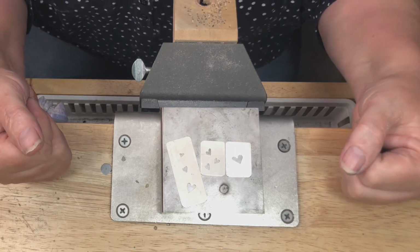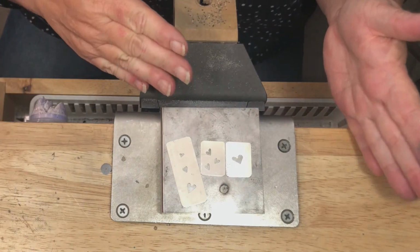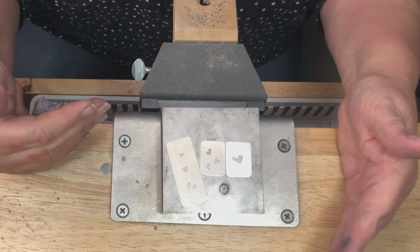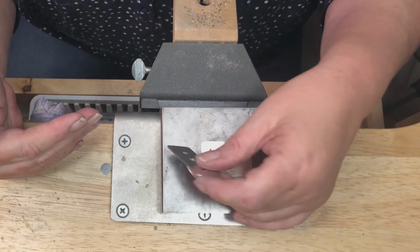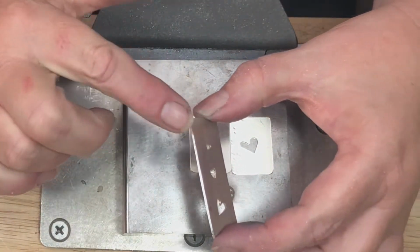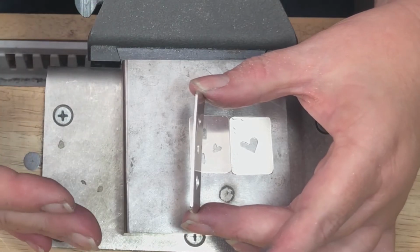I see pieces a lot of times with beginners, and they have really cute designs and they've done a really good job, but I can tell if they didn't do their finishing and their polishing as they went. There are times that you just can't get back to that place to finish it in a way that you would like it to be finished in the end. For instance, I have filed this smooth, and once I texture it, this will be rippled, and if I were to file it, I would file off the rippled edge. So there would be no way to remove at that point any imperfections with the file.